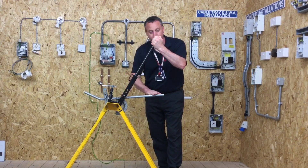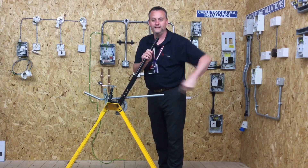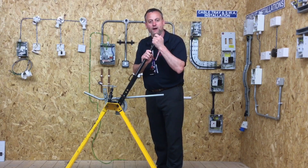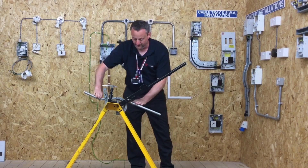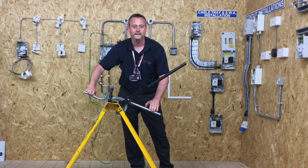This surface and the newly bent surface should run parallel with each other. You should normally keep looking as we go — I'll pull it and see where we are and we'll adjust it thereafter. We're looking for this one and this one to be parallel — you're looking at it straight on, I'm looking at it from behind. We'll go for that and then we can see how we can adjust it.